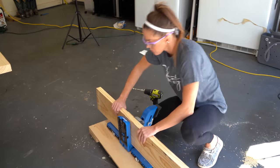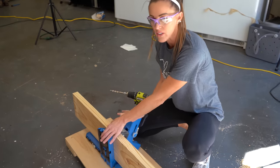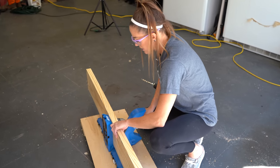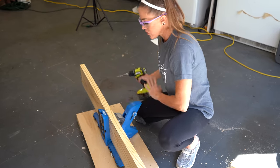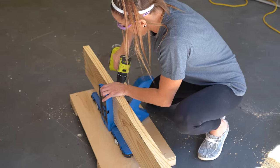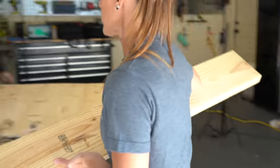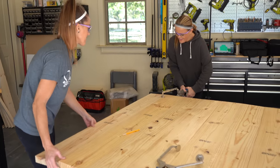I've already marked where to put the pocket holes and we are using the Kreg 720 Pro — this is our very favorite Kreg Jig model. I'm going to clamp it first. I'm drilling one and a half inch pocket holes. What we love about this jig is it makes drilling pocket holes so much faster. You don't have to switch manually between one-byes and two-byes — the clamp does it for you with very little adjustment needed. So I have drilled the final pocket holes and we're going to attach it to the headboard.